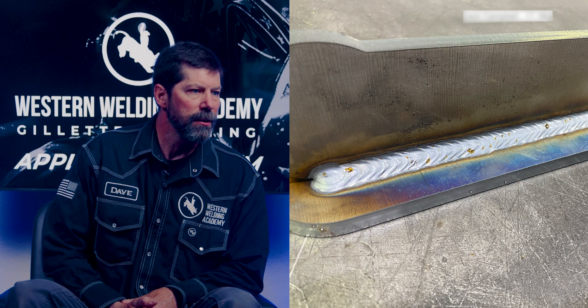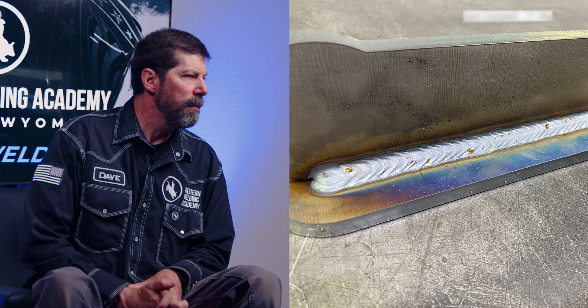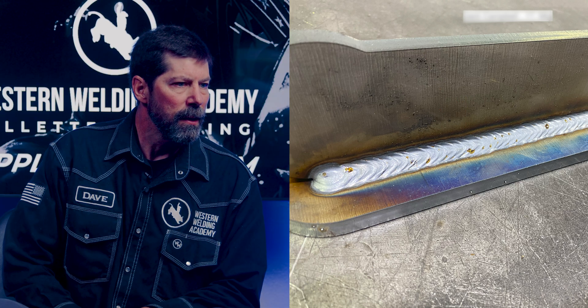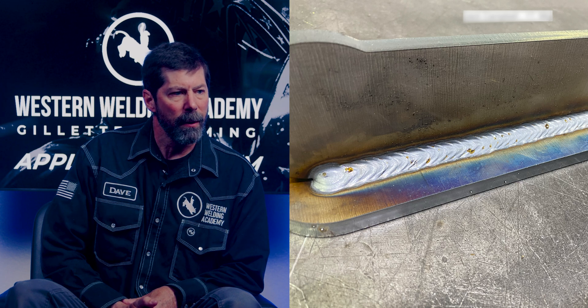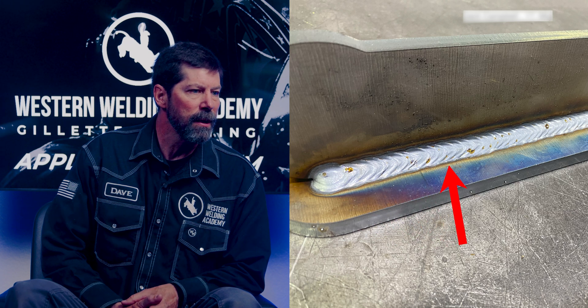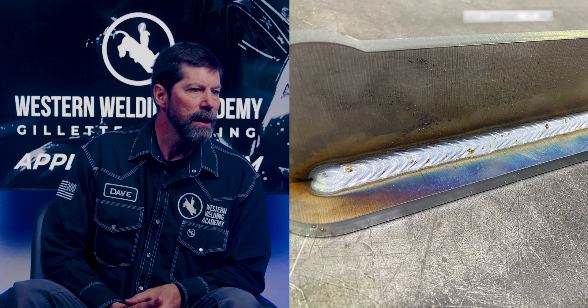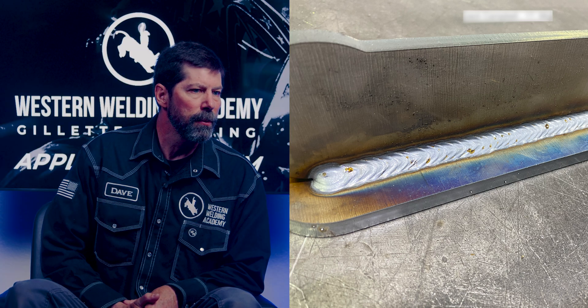We're looking at Jack. He is 17 and he's doing a little MIG welding here. Very consistent. Nice toe lines. It almost looks like you are a little heavier on the bottom of the fillet there as opposed to on the side. Maybe try to change the angle of your gun to aim a little more towards the upright part as opposed to the bottom part, which will even your weld out onto both pieces to ensure that you have good penetration onto both of them. I like how consistent your speed is — everything is spaced out kind of even throughout the whole thing there. You do have some kind of big steps, so maybe watch that speed. Make sure that you are watching your puddle so that you are getting good penetration, a nice even bead the whole time. Overall, I'm liking what you're doing. It is looking pretty good. Little tweaks to it can make it a little bit better. I do like your welds that you put down there.